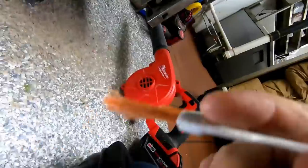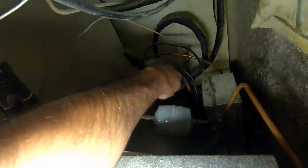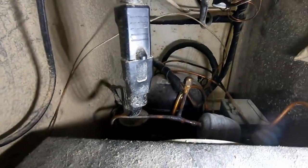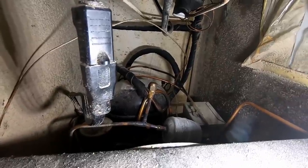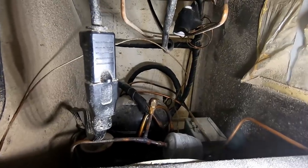That filter is not getting used. They're saying it wasn't cold at all, which really leads me down the other road - pretty warm, not cold at all means it wasn't running, which means either a control issue or the compressor's going out. This thing's been hacked on and put together ten times again and again, so it's hard to say what exactly would have caused it. We're going to just investigate here and check pressures.